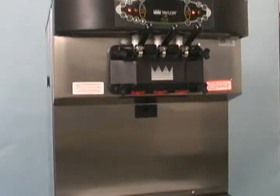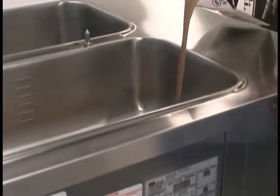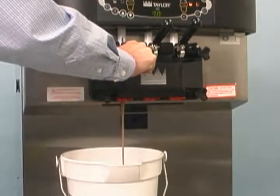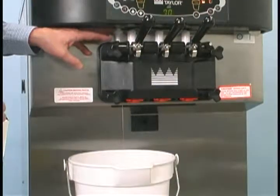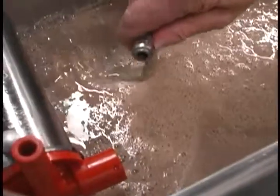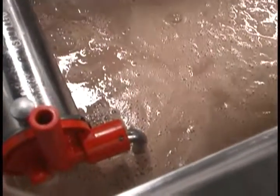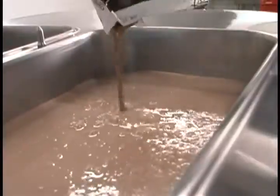To begin priming the machine, place an empty mix pail beneath the door spouts. With the prime plug in the up position, pour two and one half gallons of fresh mix into the mix hopper and allow it to flow into the freezing cylinder. Open the draw valve to remove all sanitizing solution. When only fresh mix is flowing, close the draw valve. Push the prime plug down. When mix stops bubbling down into the freezing cylinder, remove the cotter pin from the outlet fitting of the mix pump. Insert the outlet end of the mix feed tube into the mix inlet hole in the mix hopper. Place the inlet end into the outlet fitting of the mix pump. Secure it with the cotter pin. Press the auto button. Fill the hopper with fresh mix and place the hopper cover in position.